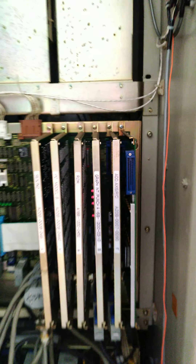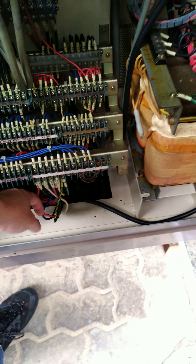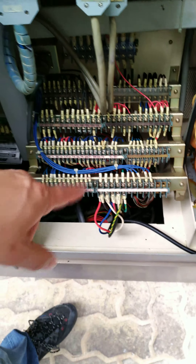I've noticed in here we've got this board with red lights. I'm going to pull out those boards and reseat them. What I did was I replaced or installed these wires here together. There's nothing hot here — I should measure voltages and see if there's anything there. I'll get the multimeter and measure voltages.